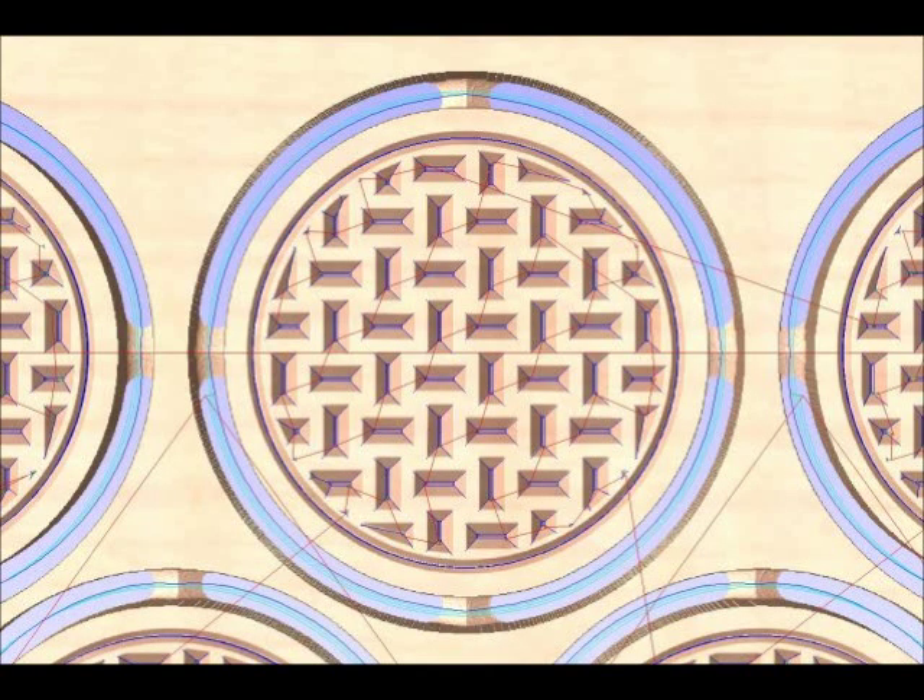Finally, I've taken the image of the toolpath and blown up just one of the coasters so you can see the detail. If you look closely, you can see how each one of these little impressions is cut with multiple runs of the tool, so you can make your major cut and then do fine cuts to really make a smooth surface. It's very interesting and helpful when setting this up to be able to see exactly what the tool will be doing.